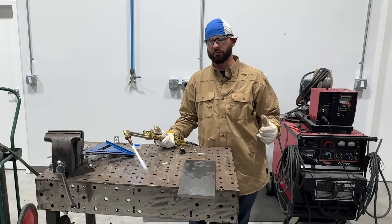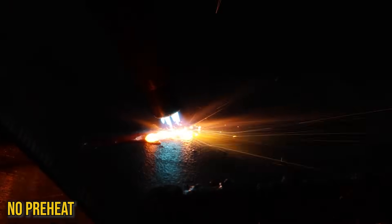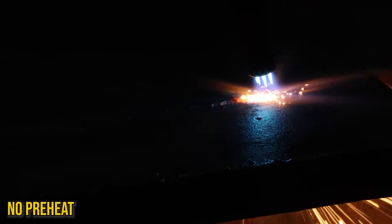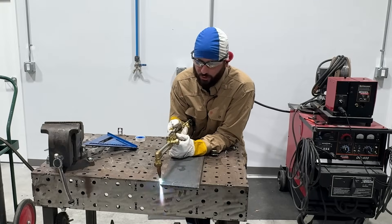One of the last things we're going to do: I've cooled this plate off and we're going to make a cut with zero preheat. It'll probably have a little bit more fight to it — it's a little wet, cold. This is three-eighths plate so it has some thickness to it. I'm going to try to cut as fast as possible. The thing is it's going to cut, but is it going to be as clean? Typically when I'm cutting with no preheat, the cut can be a little more choppy. With the addition of some heat it always makes for a much smoother cut. Traveling too fast or too slow hasn't really been that bad — I think it comes down to the fact that we have the proper settings for this material with the proper tip. It's hard to make a bad cut when you're set up for success.